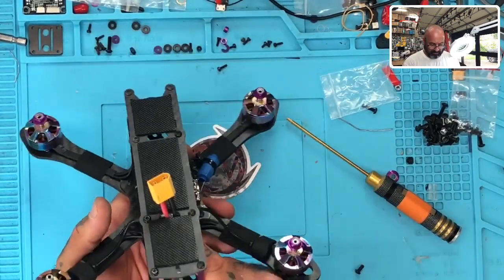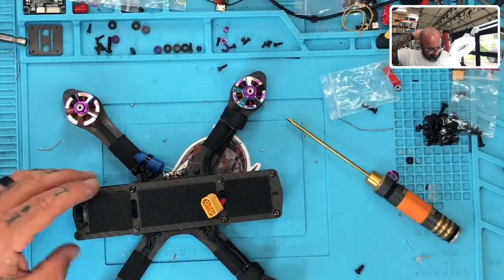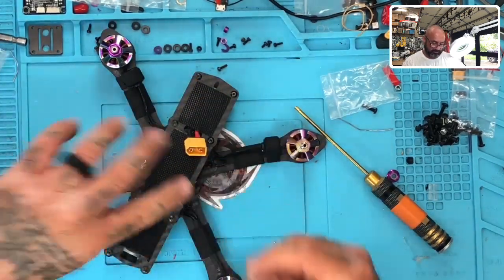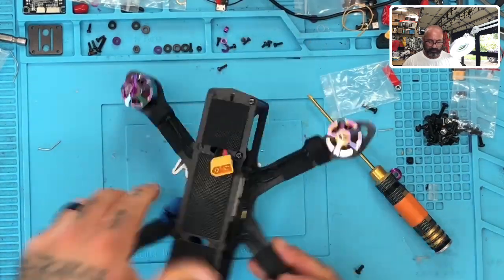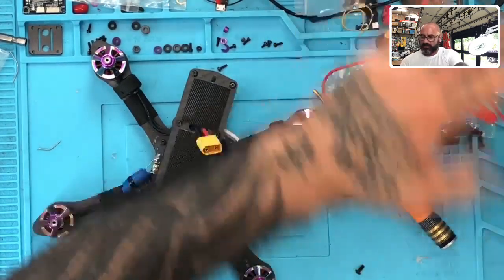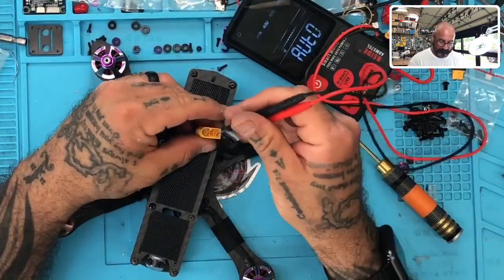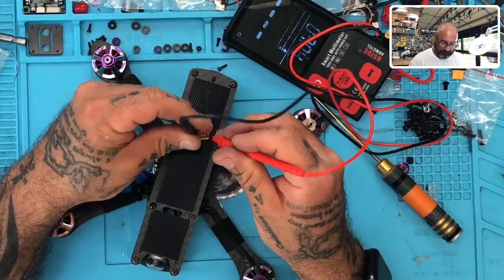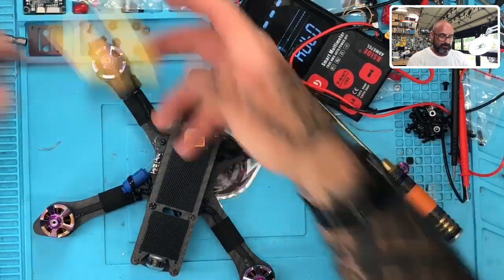Good. This is clean, guys. I'm really happy with this build and the way everything comes together. It leaves enough room. Hey, babe, you got his battery straps, right? Yeah. You want them? No, I just wanted to make sure you pulled them. Okay. Now, continuity test to make sure we're not going to fry anything. Cross your fingers. And then we hook it up using a smoke stopper. So here we go. So far, so good. Let's go ahead and hook it up with the smoke stopper.